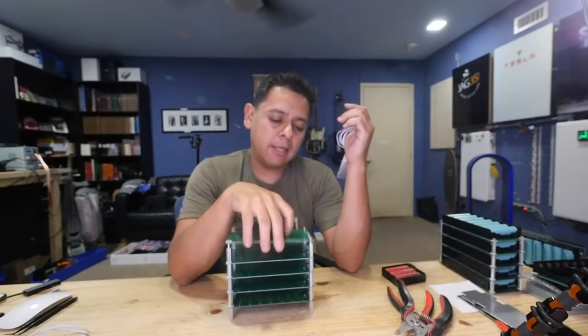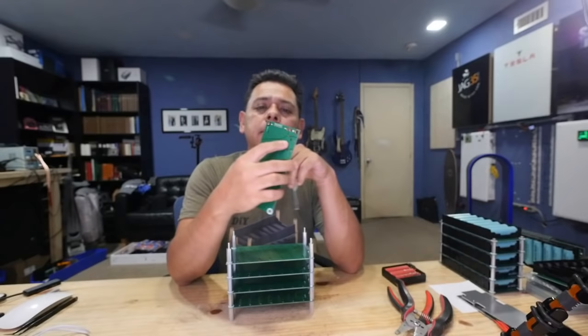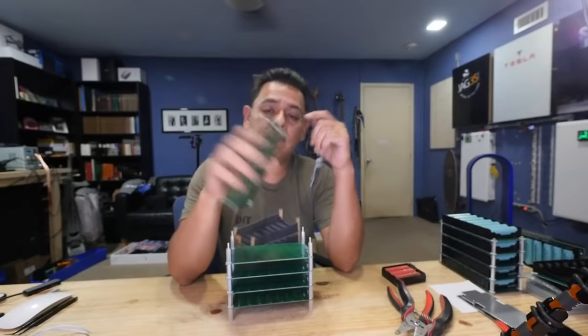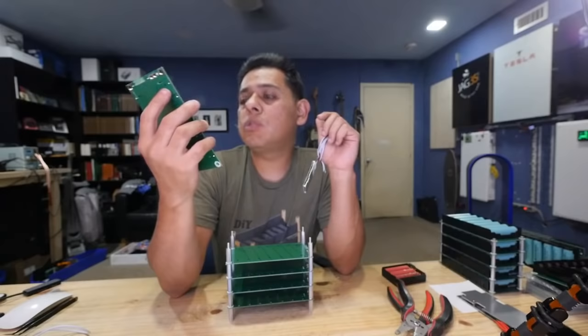And I might build in a fuse. Although I don't know that would be wise or that I'd be able to do it, because as Justin's test showed, these burn at like 12 amps, right? So even those tiny little trace fuses there are already too big. Those are 12 amp fuses, and at 12 amps, what is that? That's over 200 watts.